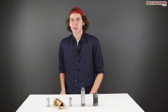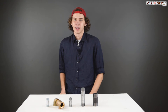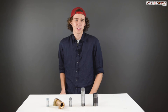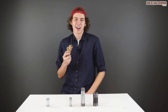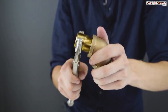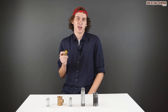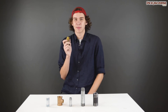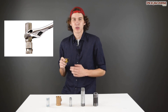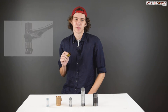If you've installed some fittings incorrectly or are just disassembling some plumbing, how do you get one of these out? With hex nipples the answer is pretty straightforward, but it might not be so obvious with something like a closed nipple. Most people unscrew one of the fittings, then grab the revealed male thread with pliers or a pipe wrench and wrench it out. This works, but it destroys the threading, making the pipe nipple useless and requiring replacement. To avoid this, you can buy a special tool called a pipe nipple remover, which grips the nipple from the inside and removes it without causing any damage.